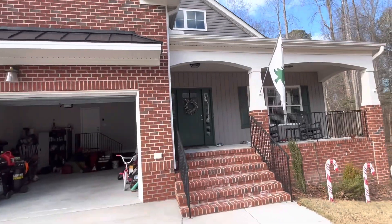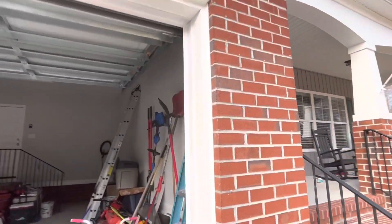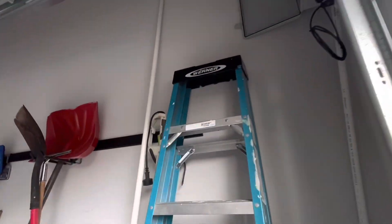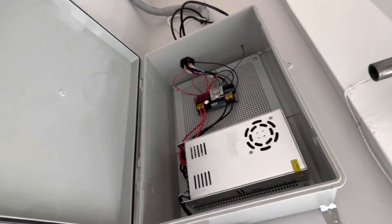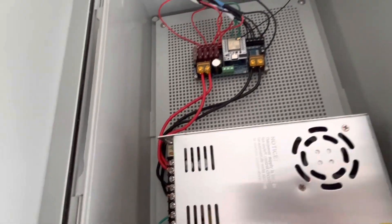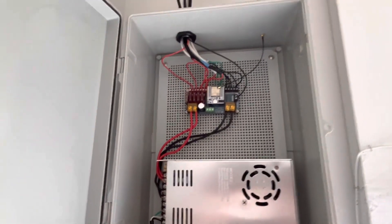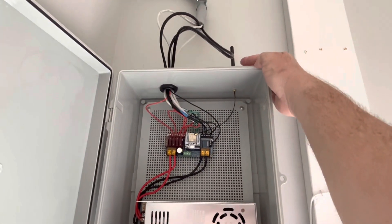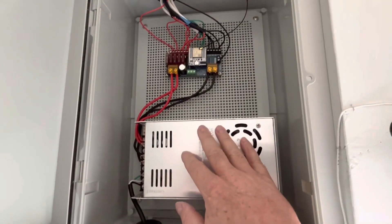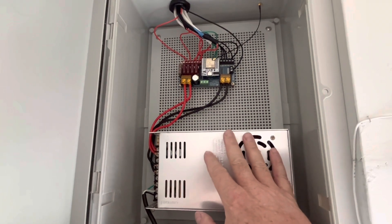This one's also running on a DigQuad. I have all the wires coming into the side of the house here into my garage. Here's my final DigQuad — the lights I'm using are WS2812B, they're 5-volt. This one's also Wi-Fi; you can see the antenna here. It's a 5-volt power supply — I think it's 40 or 50 amps, I can't remember.